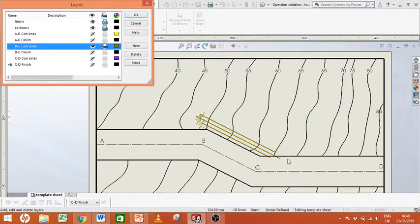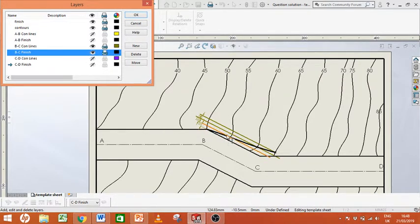We continue this on a small bit so that we can create the necessary earthworks to where the two roads cross. All we do then, as we've done previously, is match up the points to get the earthworks. We'll see further on why we continue this on a little bit further.